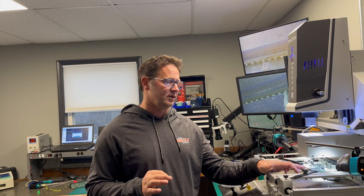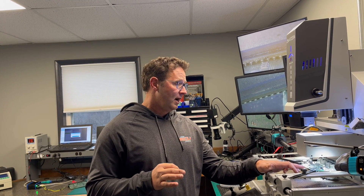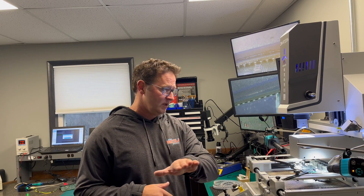One particular issue you can see on YouTube that everyone else is dealing with: the processor is a BGA and it's soldered on there with tiny balls, and it's failing. Unlike other companies, we don't just take it off, put lead solder on, and put it back on. When we strip it, we do the whole board — this is a full rebuild.